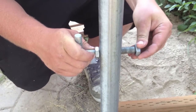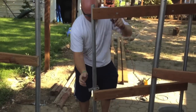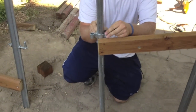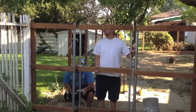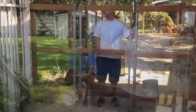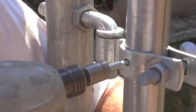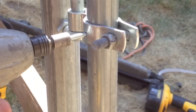Now we're going to put our J-bolts on our post. Those are adjustable hinges, so if your gate ever sags, you can adjust the sag out of it. Line it up and make sure the rails match evenly, then tighten the bolts down on the females. We like to put set screws in the females — it just keeps it more sturdy.